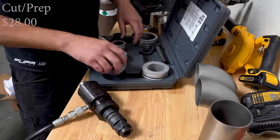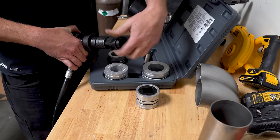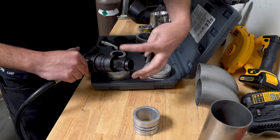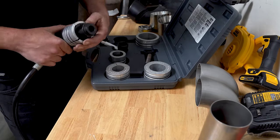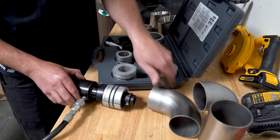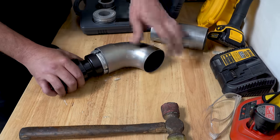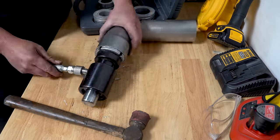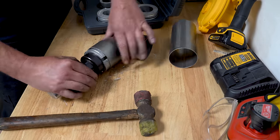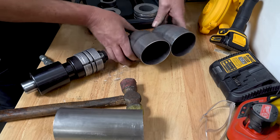The next stop is to expand the tubes for a slip fit — this is also sometimes called swaging. The tool I'm using is a DIY setup assembled from multiple tools. Normally entry-level tools like this start around $4,000, but this particular one can be put together for roughly $200 to $600 depending on how you upgrade it. I'll have a complete list with links in the description if you want to build one yourself. If you don't have the money, just run down to an exhaust shop and have them do it — it may be free or maybe $20. With this kit it just takes a little more time because you keep tightening and rotating until you get the fit just right. And make sure you put some oil on it.